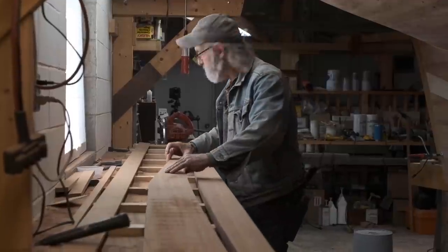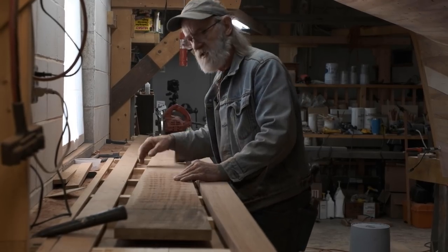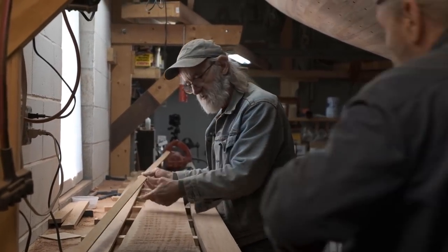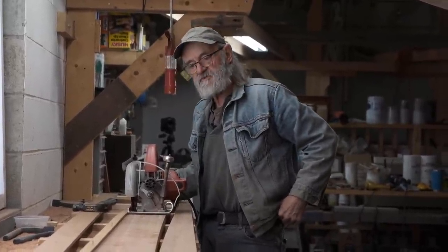And I've got one more cut. I'm going to move the thing down on the bench right here. And this one we'll probably cut with a smaller batten because it's going to be a little bit more curved, I think. Well, we made our first progressive cut, and that's where the plank fit against the rabbet.